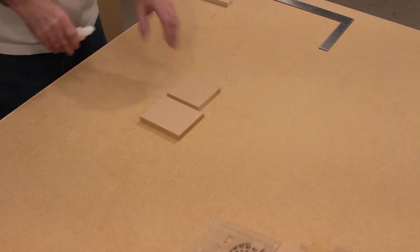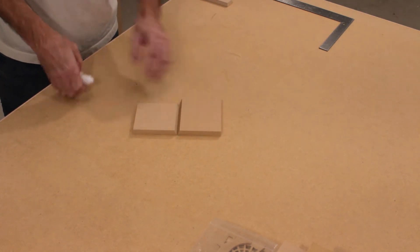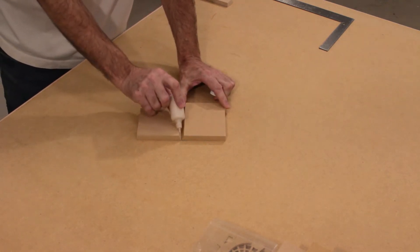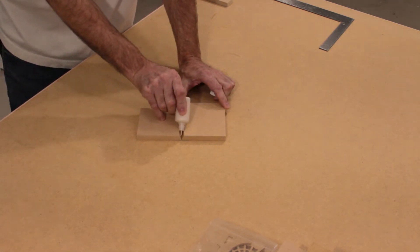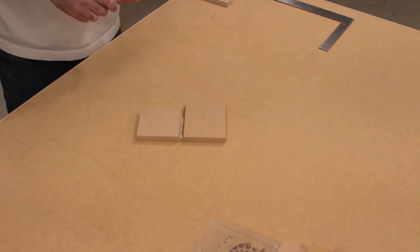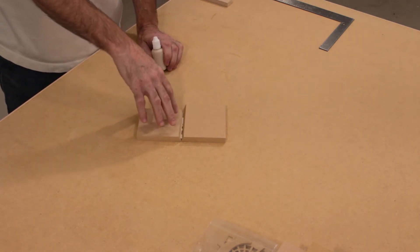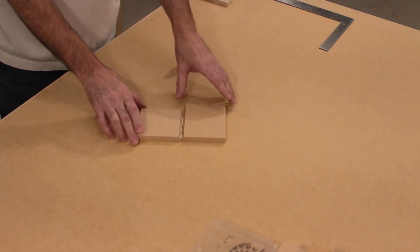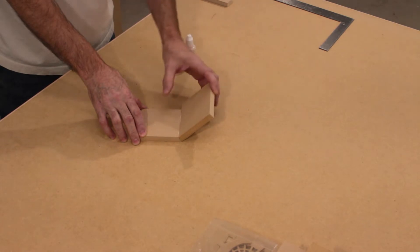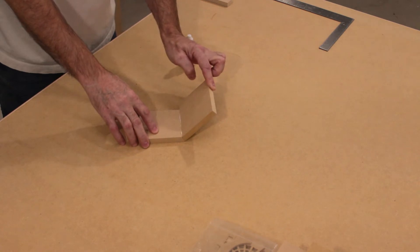For an example, I have a V-groove between two panels here. I would apply a bead of glue to the lower part of that V. Using my glue bottle I will apply just a small bead — about 3/32nds of an inch or about the thickness of a cooked grain of rice. You want enough glue that it gets squeezed out when we close the panels together. You can see it squeezed out along the entire surface, which is good.